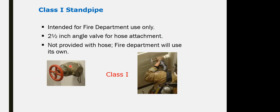The valve itself could be used as a tamper valve, which will be connected to the fire alarm control panel. So in case of fire, this one is considered a manual initiating device. In case of fire, it's opened by rotating, allowing the water to flow, and from this one it gives a signal to the fire alarm control panel and starts the fire mode scenarios as well.